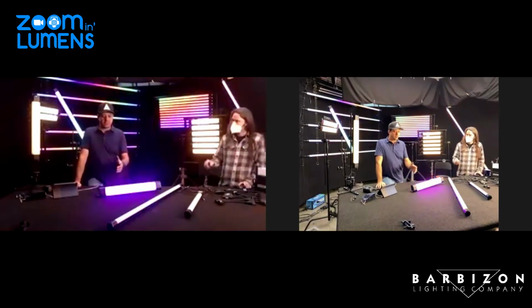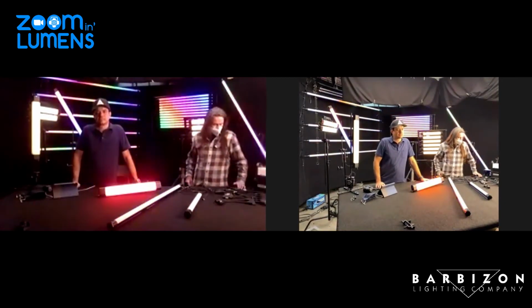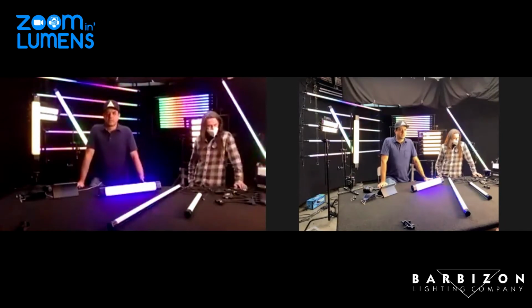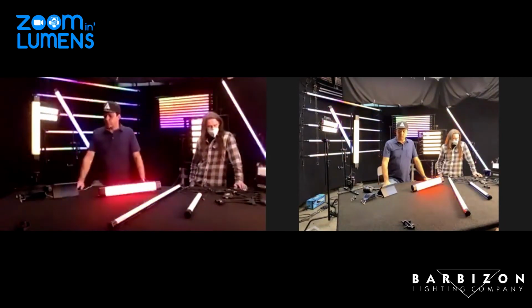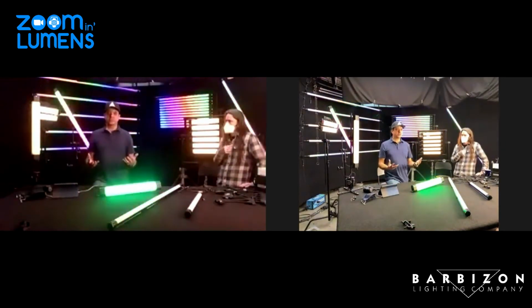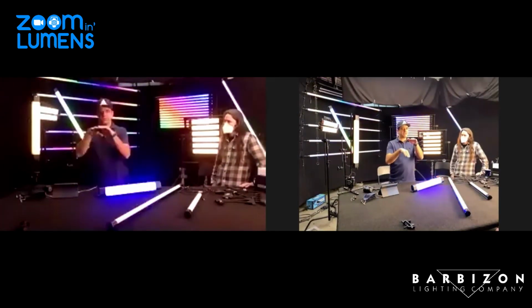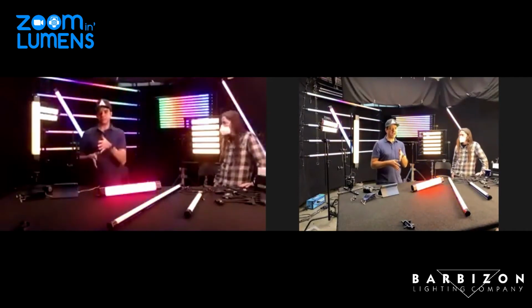And Dan, we got another question real quick, on connectivity. So in Bluetooth mode, if I'm controlling the lights over Bluetooth, am I grabbing this light and controlling it, setting it the way I want it, move to the next one, move to the next one? Or can I grab multiple lights and control them individually at once, if you will? So the nature of Bluetooth, just like with your phone, you're limited by the amount of Bluetooth devices you could connect to. So when I open it up in Luminaire, I see all the available devices to connect to, and you could connect to maybe 3 or 4 of them at a time.